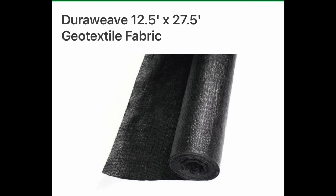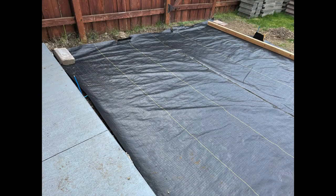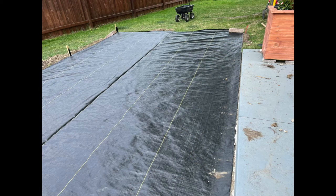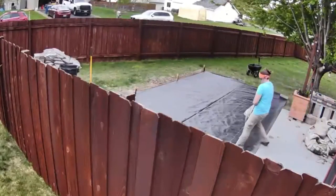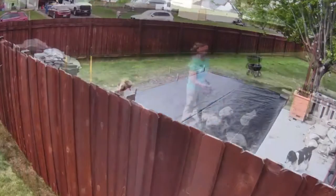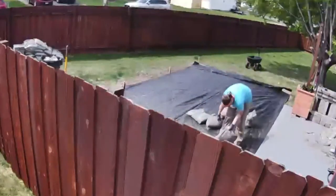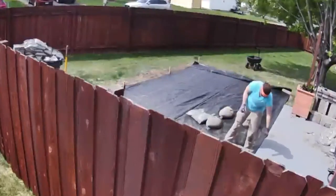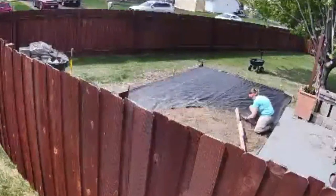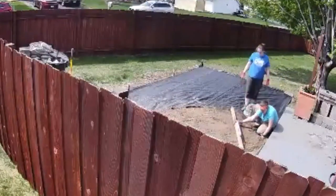When the ground was level I placed geotextile fabric on top to help prevent weed growth. I was able to purchase a roll that almost fit my dimensions perfectly — I barely had to cut and had absolutely no seams. I placed pavers on the tarp to hold it down while I worked. Our first layer of sand is paver base sand, which has some rocks and is supposed to help with drainage. We carry each 50 pound bag over, cut it open, tear off the top, and dump. I started in a small section and packed it in, emptying the bags in an arc wherever that 2x4 arm could reach, leveling as I went.